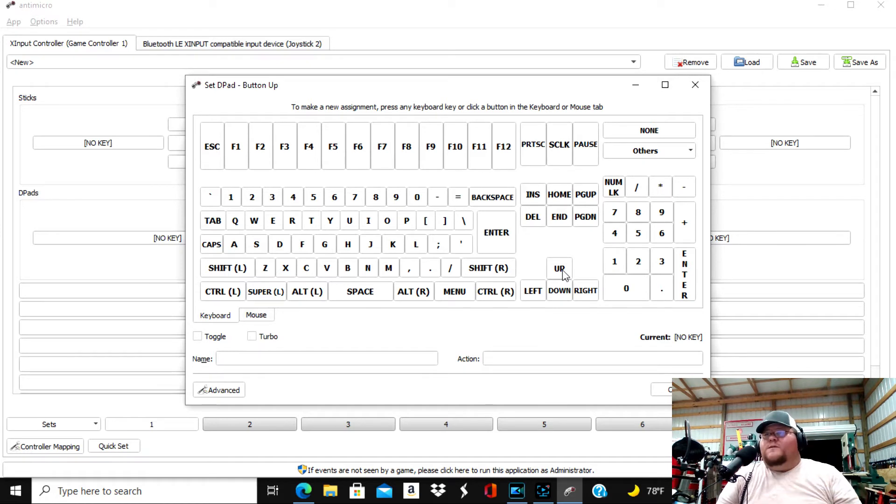You should know that when you hit Shift plus Up, Shift Left, Shift Down, or Shift Right, that moves it at the max speed allowed for your machine — whether you have Nema 23s or Nema 34s. Same thing for the Z-axis: Shift Page Up and Shift Page Down will move your Z-axis or spindle up and down at the fastest rate allowed.